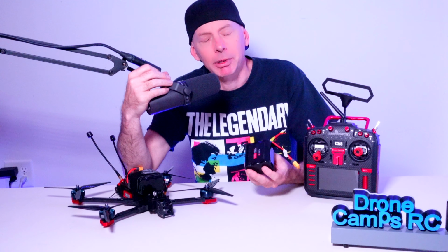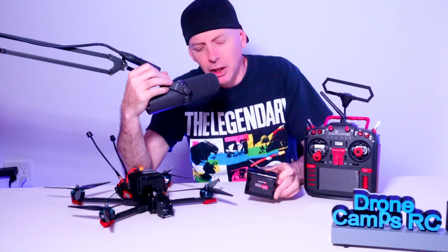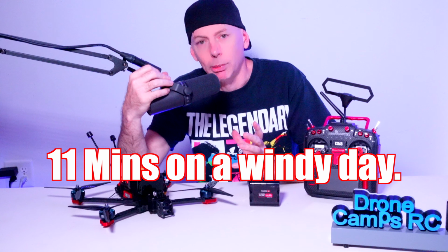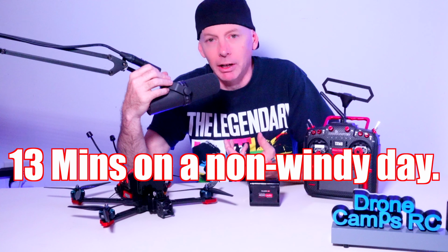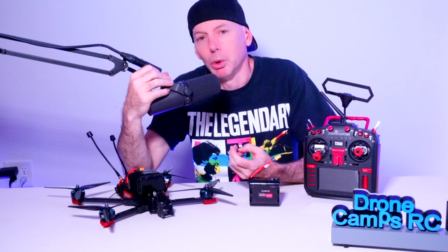Also, you're probably going to get 15 minutes on the other Chimera, the original one, with a little less KV in the motors. This one has a little higher KV, so you're going to get a little less flight time out of it. I tested this one out to about 11 minutes on a super windy day. On a non-windy day, I'm expecting you could probably get around 13 minutes maybe. And if you're carrying a GoPro, probably more like 10 minutes.